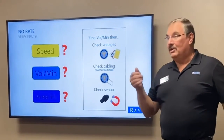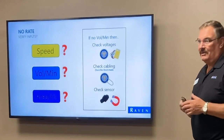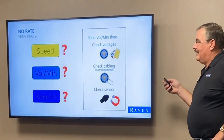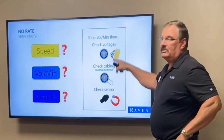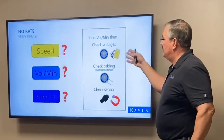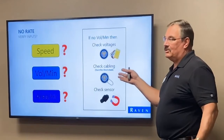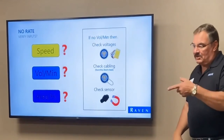By tightening the jam nut, the turbine can no longer spin freely. I told him he'd have to go back and readjust all of them. So if you get one that doesn't rattle, that's bad — something is jammed. Check these components before throwing in a whole new flow meter. With the right tools, it takes maybe five minutes to check this out before replacing a seven-hundred-dollar-plus component.